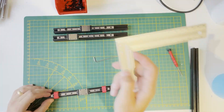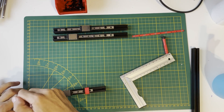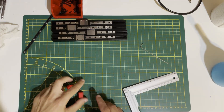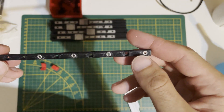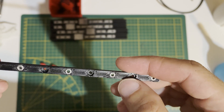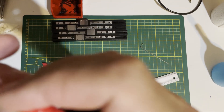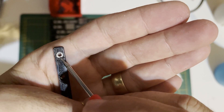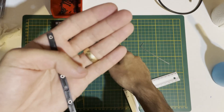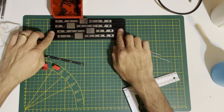I will reprint the damaged part but we can continue. For the Z rail there should be a 33 millimeter offset — I found using a fixed reference easier than a caliper here. The Y axis is also finished. Here's a tip: first place the nut, then with a small screwdriver apply super glue only at the corners after placing the nut — don't go inside, only apply at the corners. This works well and I hope it will work for the X axis too.